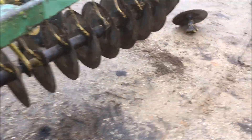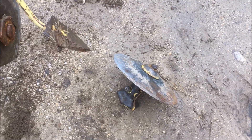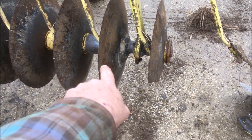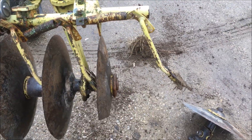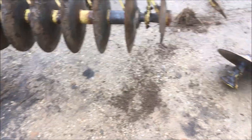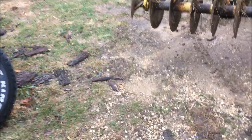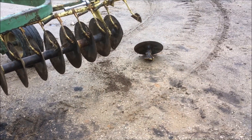This disc has eveners — ridge fillers, we call them ridge fillers up in my area. They clamp on to the outside. This disc has 20-inch blades; the ridge fillers have 16-inch blades. The idea is to kind of even out and knock down the ridge that the disc leaves in the field. So I've got two outside blades to replace, plus a blade on the other ridge filler that's broken. I need to pick up two 20-inch blades and a 16-inch blade.